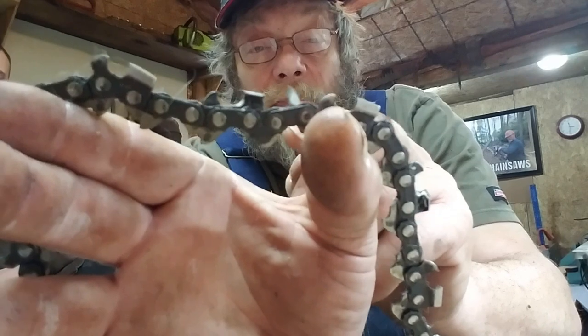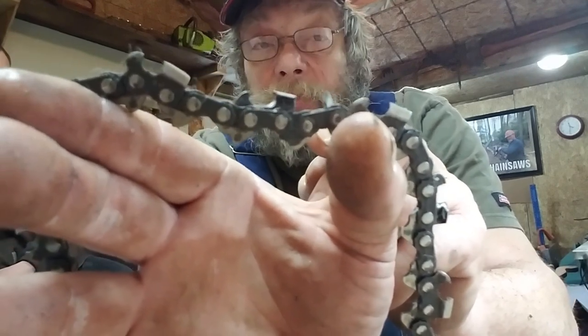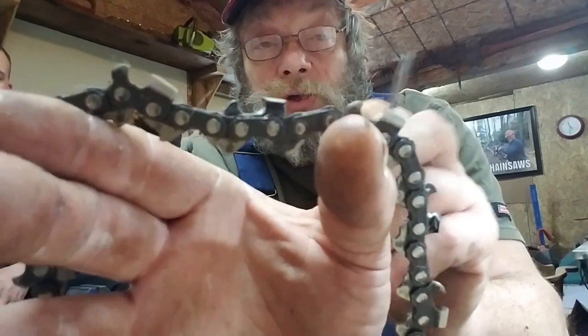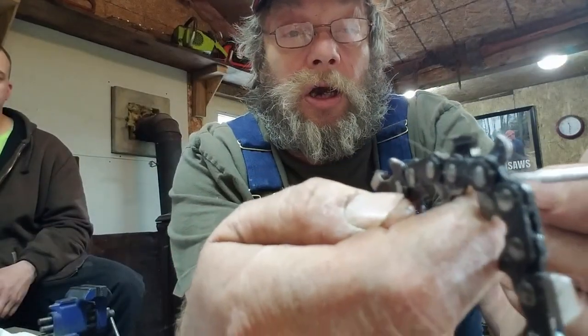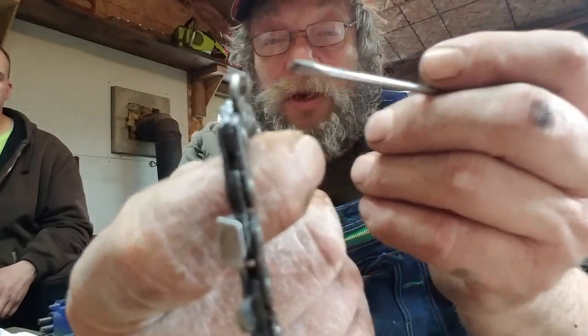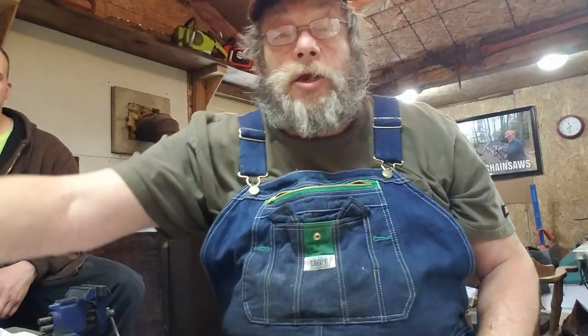Okay, you have that much room. Your bar is buried. It's doing that top side of the bar, around the tip, and bottom side of the bar. It spills. Those of you circle mill guys understand spilling. And then it starts coming around the tooth, gets caught back up in, stops the process partially, recuts the sawdust. So you're spending horsepower recutting sawdust. Alright, that's the deal right there.